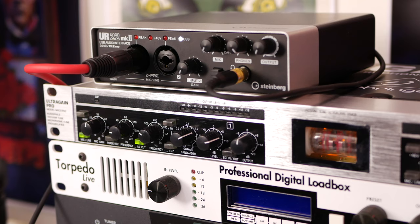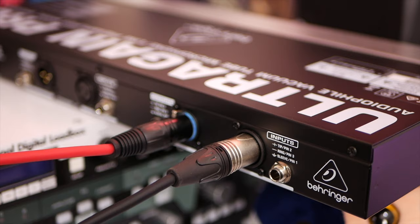This is how it sounds now with the low cut enabled and the EQ back off — I think this sounds really great. This is how I'm going to run it for my particular setup. If I need to EQ anything at the end I can do that in post, but I just want a nice clean signal. This microphone now sounds way better going through this unit than straight into my sound card, no doubt about it. This is one of those mics, much like the Shure SM7B, that is just a really low output microphone. Unfortunately, you do need some sort of preamp to get the most out of these.